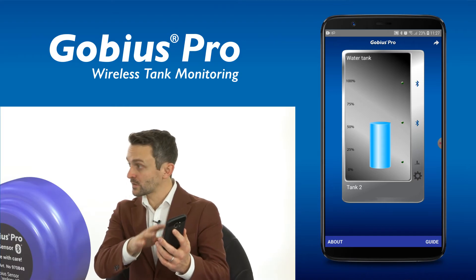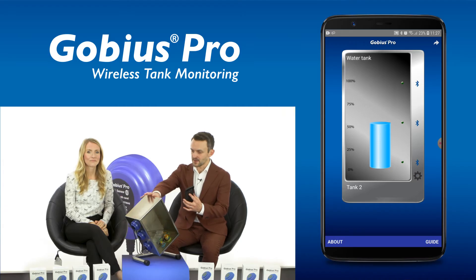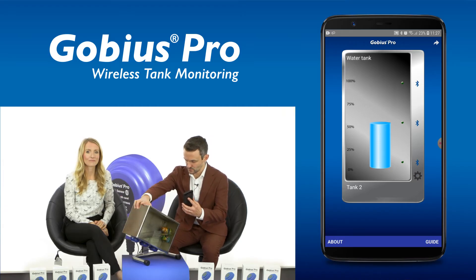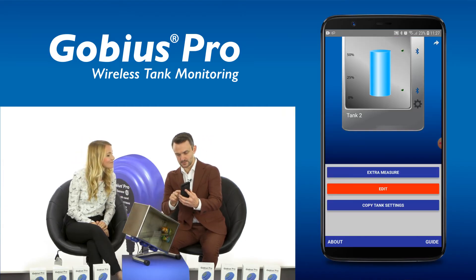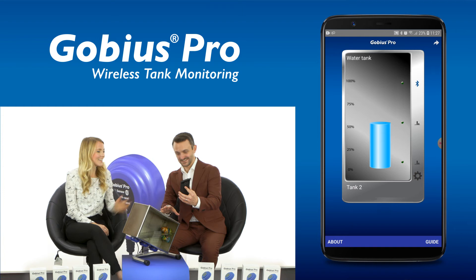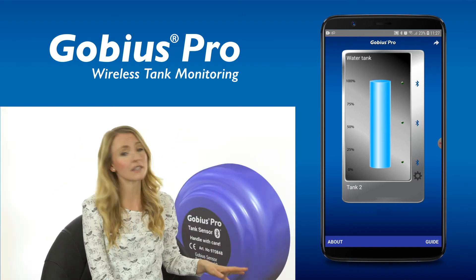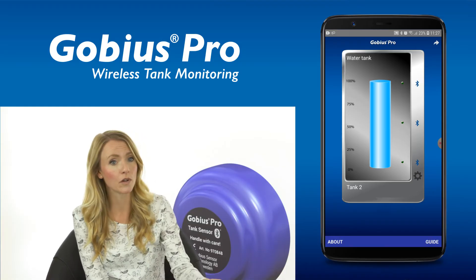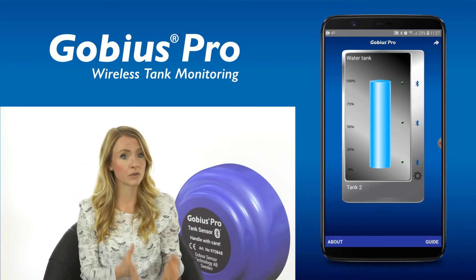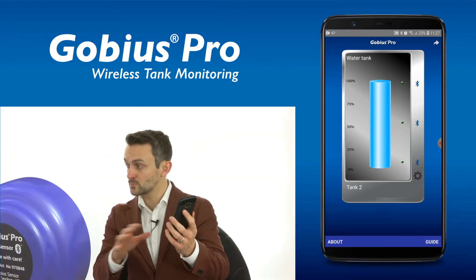There you go. The bar is showing halfway and it is reading correctly. And if I tilt the tank to full and click measure again — now we have full bar. The fisheyes can be set to light up if empty or full. The outputs can be used to switch or trigger another external device, pump or valve.